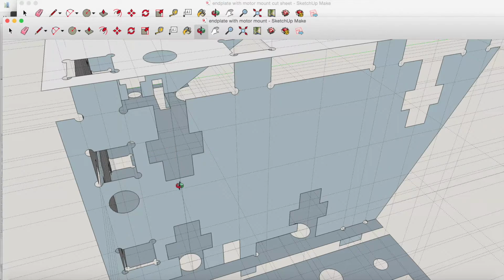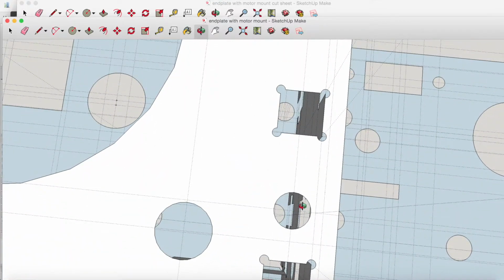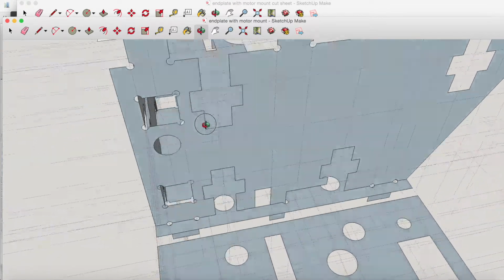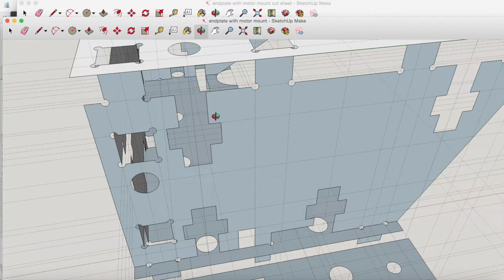And this vertical slot here is for the bolt, and that corresponds with the circular hole here in the top plate. So if I show you from the top, this hole is aimed right for the center line of where that 5mm sheet of acrylic will be, heading straight down, and the bolt will occupy this vertical slot here and screw into a nut, and that nut will then pull this entire surface towards this piece here when you tighten the bolt.